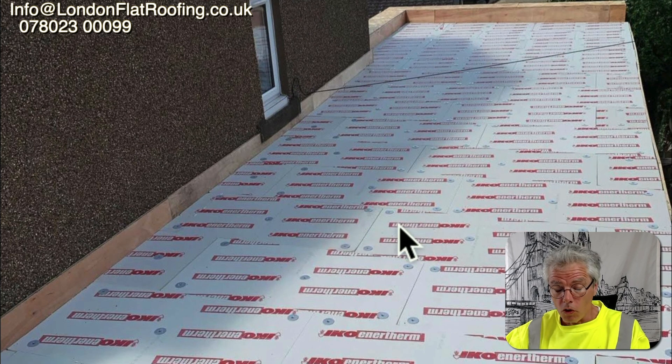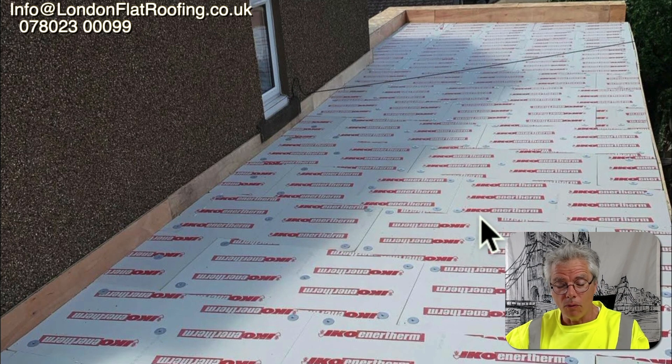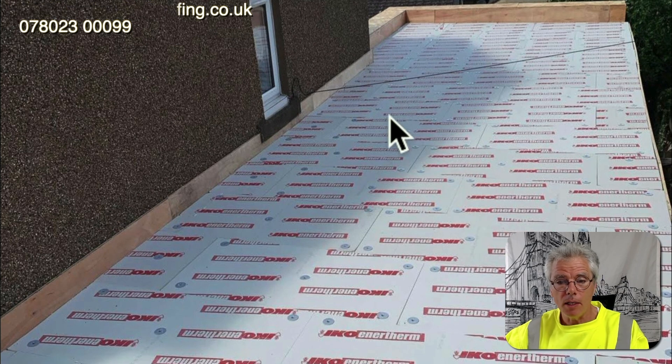To answer the question, we don't see it as a problem. Even down in London, tissue faced insulation is really quite expensive and people don't stock it, so we've moved over to using PIR with foil on it - even though I don't entirely agree with it, it's a cost situation and we're not seeing it go wrong. Theoretically, two layers of insulation with staggered joints using foil-faced PIR, well put together, works well depending on what you're putting over the top. Most of what we're doing down here we're putting OSB on top, giving a huge sandwich underneath.